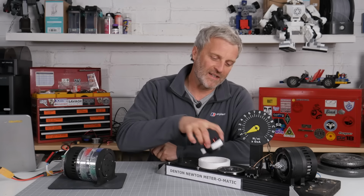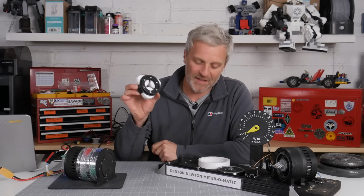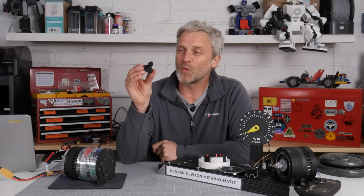Well, I set out to decide if I could actually make a mini Mantis using 3D printed 2-stage planetary gearboxes. And I think I could. I mean, I know I've destroyed this, and I destroyed many of the 2nd stage sun gears, which was the weak point, but it did get to 125 Newton meters of torque or more, and that's probably enough.